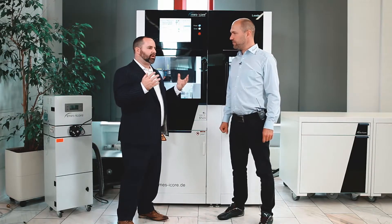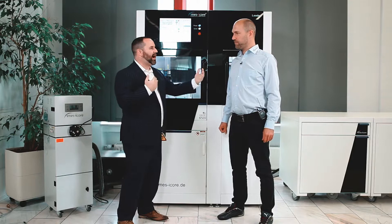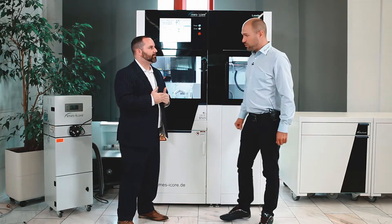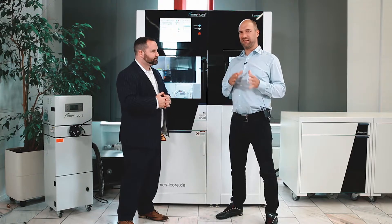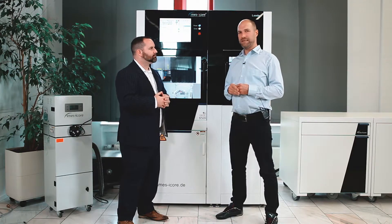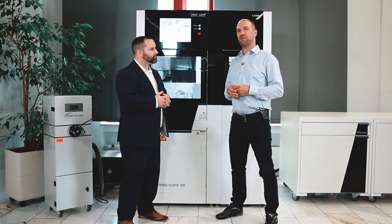If a lab owner is looking between the 350i Pro and the 650i, why jump up to the 650i? It depends on the volume. In general, the 350i Pro can do the same applications as the 650i. But if you have one or two implant bars per day, the 350i Pro should be alright. If you have high production on these high-accuracy frames, we always recommend the 650i. Also, the 650i needs less maintenance — because of the linear guides and torque motors, there's no maintenance needed, or at least after five years you should have a maintenance. The 350i normally has ballscrews and guideways, so you should have maintenance at least after two years.